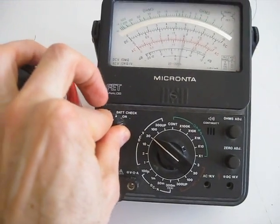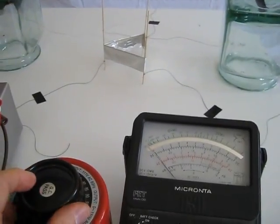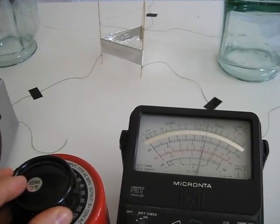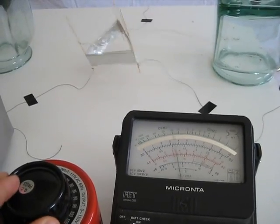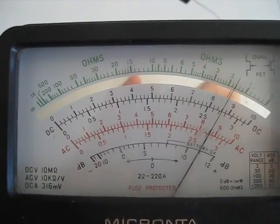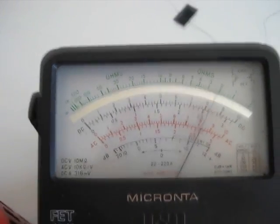First I'll turn on the meter, then the power supply, and watch the dial as the lifter flies. So I'm up to 20,000 volts, and there we go — it's flying and I'm at... so that's around 27 kilovolts, 27 and a half. It arced there — that's why it jumped. So that's the probe in action.